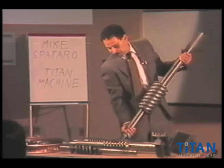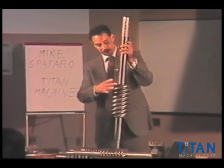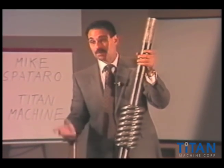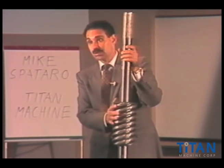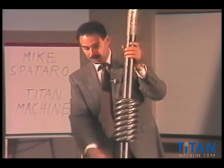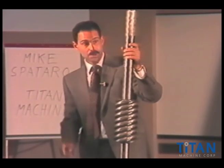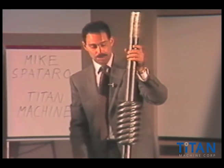Here's another example. This came out of a large old Otis machine — this is a four-start: one, two, three, four. This happened to operate with a very slow motor — an 800 RPM motor gave you a certain speed. Some of these have 1200 RPM or maybe even 1700 RPM, depending on how many revolutions the motor is traveling. That's really going to determine your ratios.